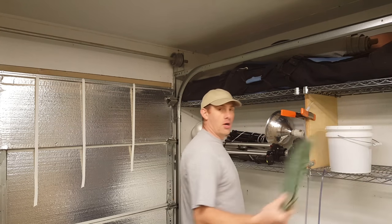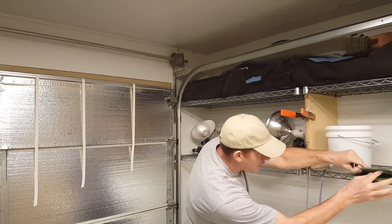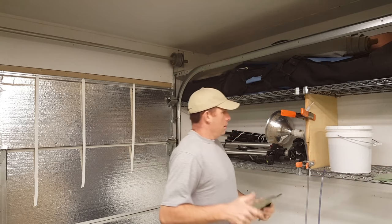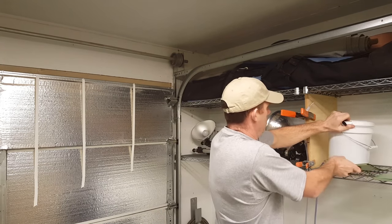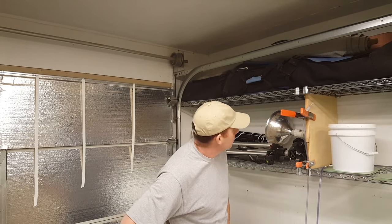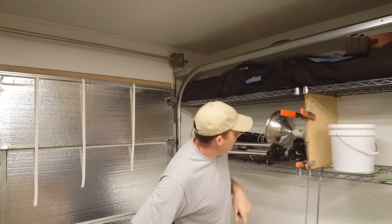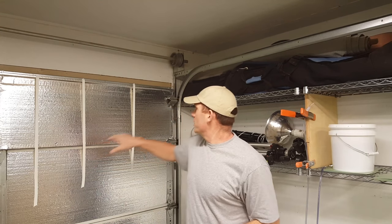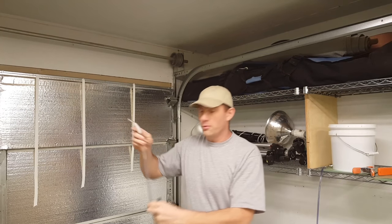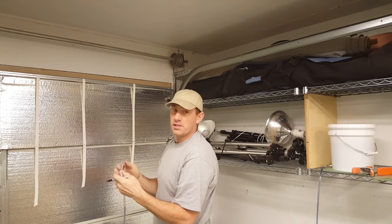So what I usually use is some cardstock. This is just some cardboard. And I'm just going to grab what I think is about 3/8 of an inch, and just slide it under my reservoir. And I'll wait for this to settle. And you can see this is sloshing a whole lot, but it still doesn't move a lot in the hose. I think we're good. So now I've got some tape over here that represents the wires that I would mark. So this could be anywhere in the room now. It's as easy as that.